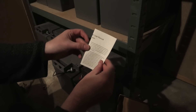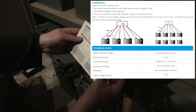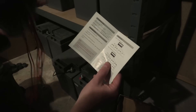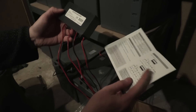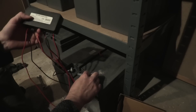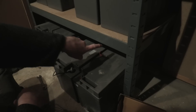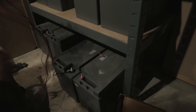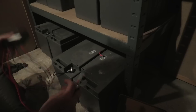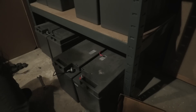We need to check the manual here - it's important to have the most positive and most negative in the right order. The battery equalizer connects like this: the most positive lead goes on here, then they're all mingled up, and then this one has to go on the back where the batteries are connected. The negative and positive of the next one connect at the back of the batteries and then the two at the front, and the balancer will start to work.